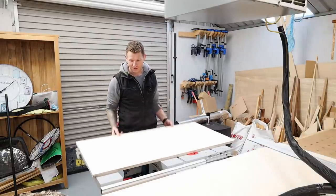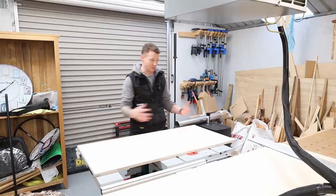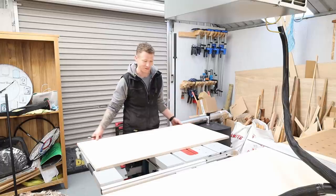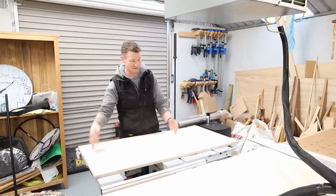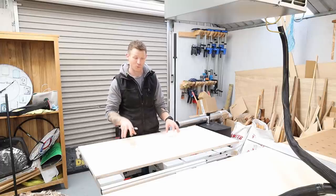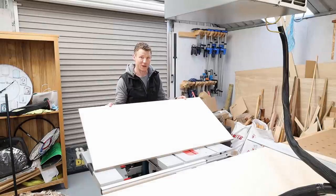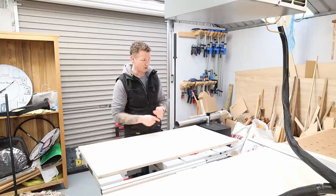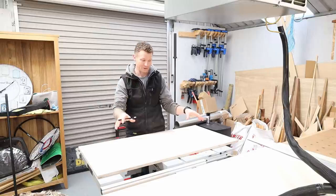There is the base of the cross-cut sled — four foot by two foot, or 1.22 by 600. That's actually going to be a nice size. It gives me about 500 millimeters to the left of my blade and about 700 millimeters to the right — about 20 inches to the left and 28 inches to the right — and it increases the capacity of the machine. Next I want to cut my back fence. The base doesn't have to be perfectly square — we'll square the front fence off our blade. The back fence is just a stabilizing fence, so it doesn't have to be square to the base either.